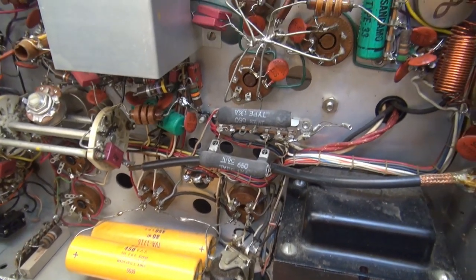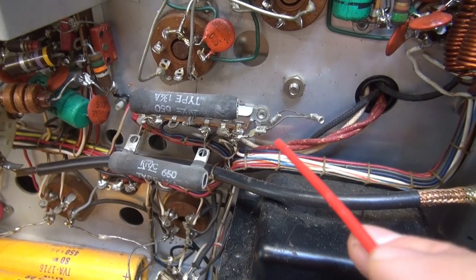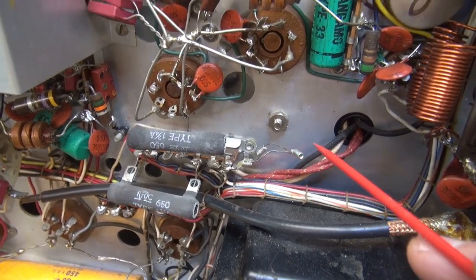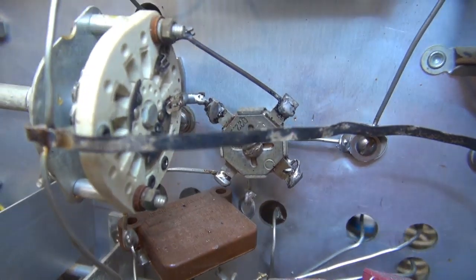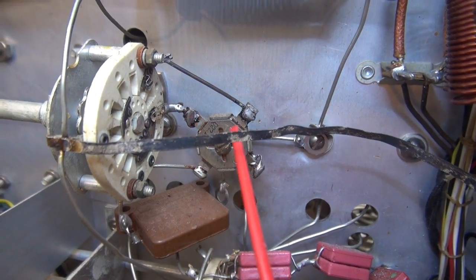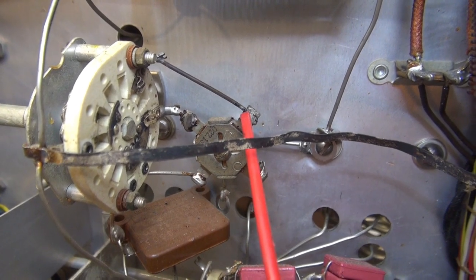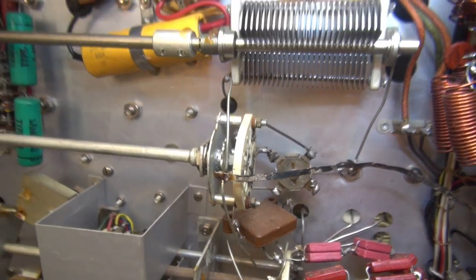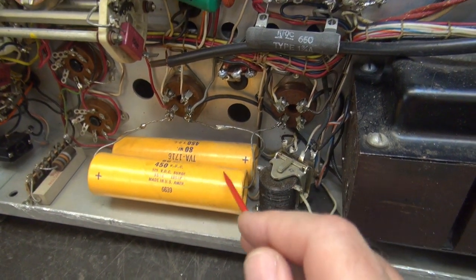Other than that, I spotted a couple other things. Here looks like a homebrew current shunt for the plate current — so obviously the little loop-de-loop that Johnson did must have failed, and somebody put that in there. Then we get up here, and this is also a little bit alarming. This is a multi-section mica cap that they used on the back of the loading switch. If you take a look at these terminals, you'll see they're kind of gray and there's little black marks around them. I believe these connections are cold and it's been arcing. So before I even fire this thing up, we're going to correct that. We're going to put in new caps, and especially down here, I'm going to support these with terminal boards so we don't have this going on.